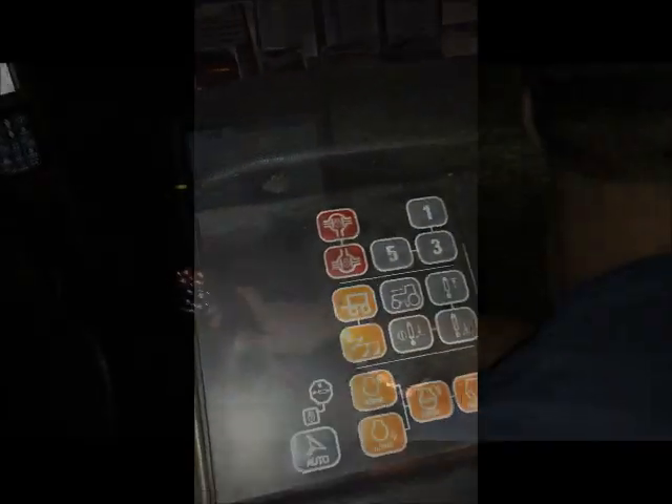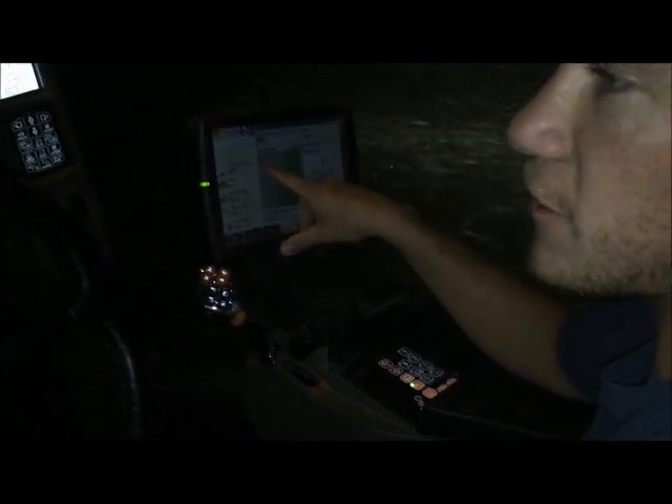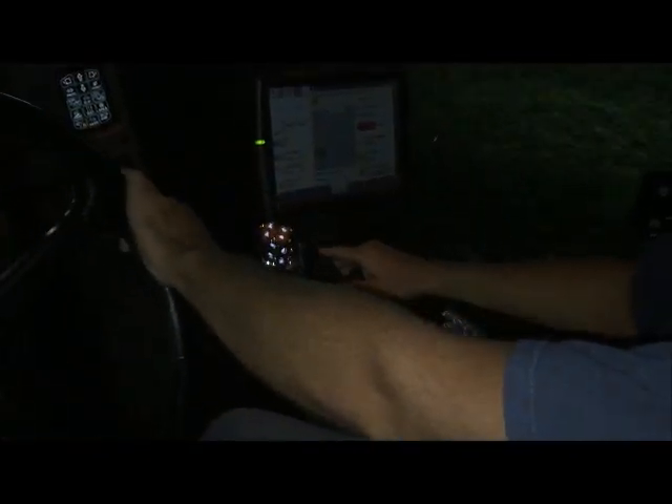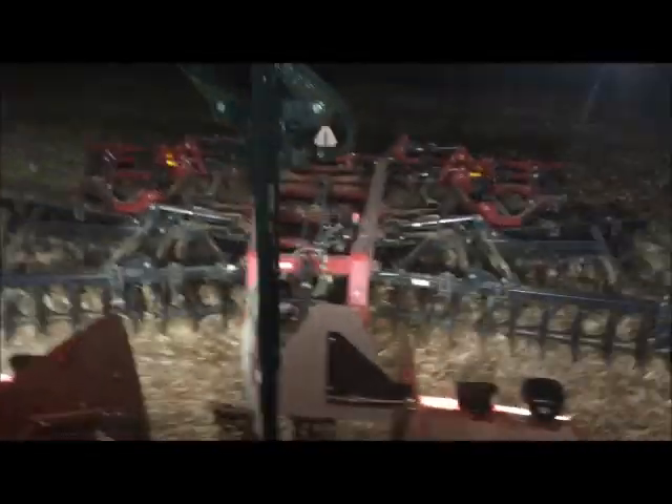That's basically the inside of a Quadtrac. The tractor actually has a sensor on it to tell you when you're getting close to the boundary or the last place you turned around at. So when I come up to the end of the field, I usually slow down a little bit, kick it out, lift the tool up, and slow down just a little more. The tool lifts up, you make your corner — make sure not to turn too short and catch the track end of the tongue of the implement. You turn back around until you get close to your AB line. You get close, let off the steering wheel, hit the auto steer button to engage it. Next you let the implement back down into the ground, get back up to your target speed, and push it all the way forward. That's basically all I have to do until I get to the other end of the field.